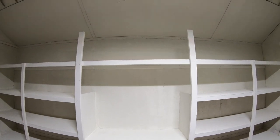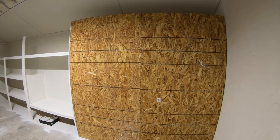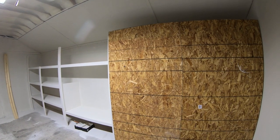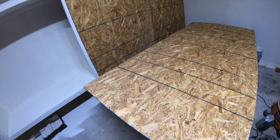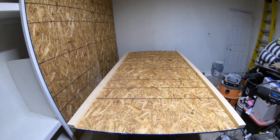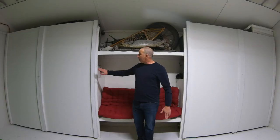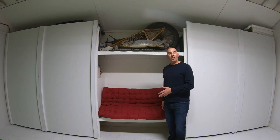Now I'm ready to start fitting the OSB doors to cover up the storage. Here's a quick look at a dry fit of the two doors — I'm going to use interior door hinges and add a 2 by 3 down each edge of the board. First one operational — use the level to plumb it and make sure it's all good. Here are some final shots — nice and clean. Now I'm going to work on that DIY bench. Thanks for watching.